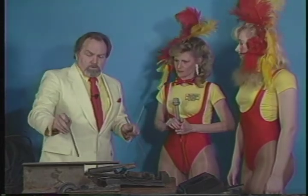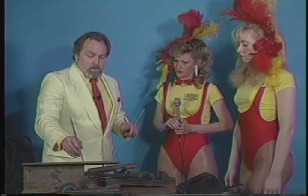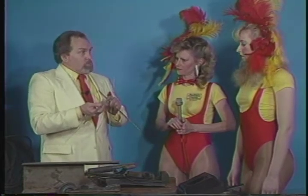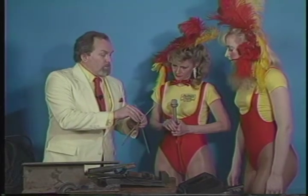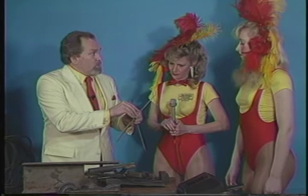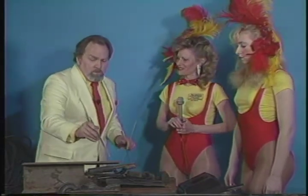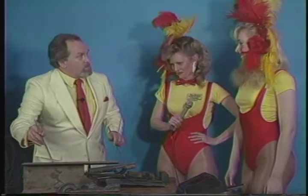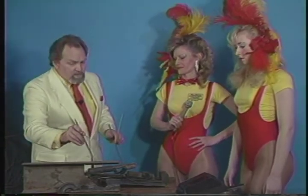By virtue of putting this on here, and sometimes you've got to whack it a little bit to establish it, you can establish the arc without the metal actually touching it, and the way it burns in, you can see that the actual filler metal is held about 1/8 of an inch away from the metal itself, and you don't have to hold this off. You literally drag it across on the surface. It's called contact rod, and it makes contact as you go along.